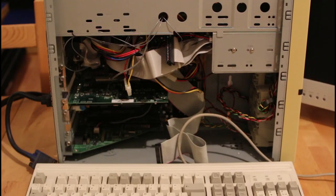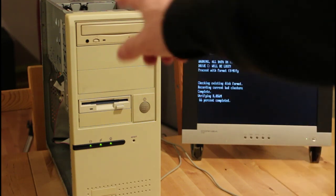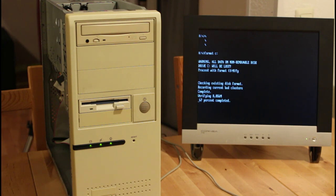I looked up the mainboard in this machine and it turns out to be a fairly generic A5 MVP3 mainboard made by Lucky Star Technology, which I've never heard of before. Interestingly, people claim the VIA MVP3 chipset it uses is actually slightly faster than the ALI chipset, so I'm going to be very interested to do a comparison in our benchmarks. I found a Maxtor 8-gigabyte drive from 1998 to put in — it's only ATA 33, and the newer board will actually support ATA 66, but I want to keep everything the same so it shouldn't affect our benchmarks. The CD-ROM is a 12x CR584B, which was quite common.